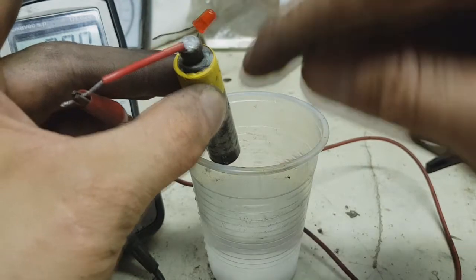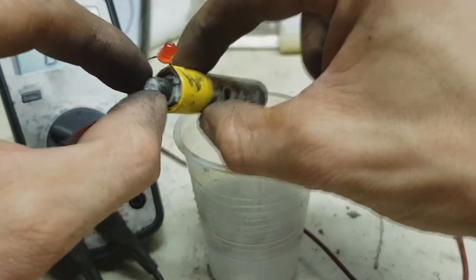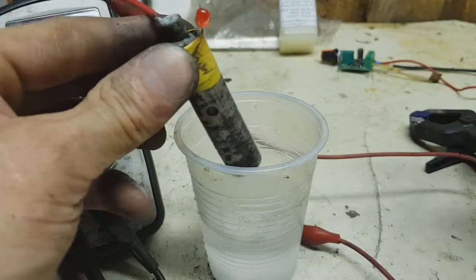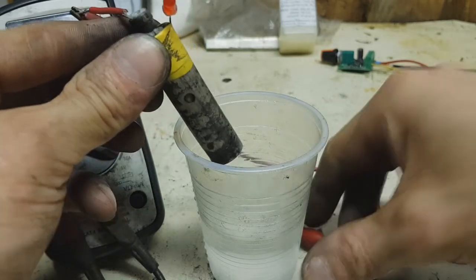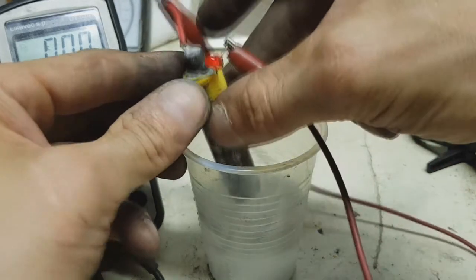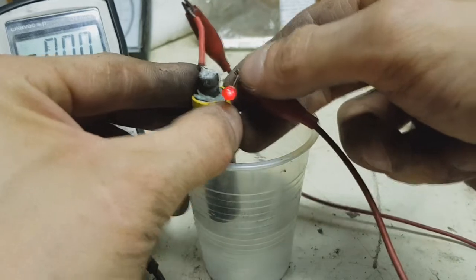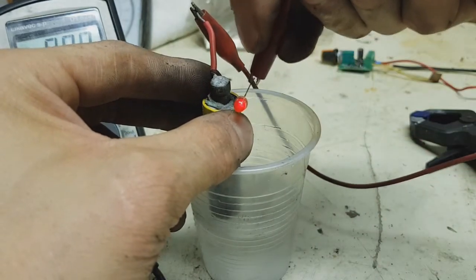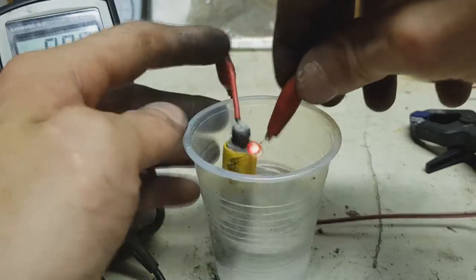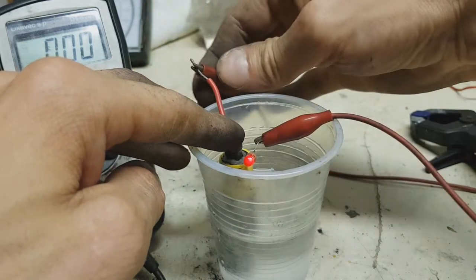I compressed it a lot so you cannot easily move the cathode from the anode. I used only two grams of active material. If you use more active material you get better power, and also the capacity depends on the active material.